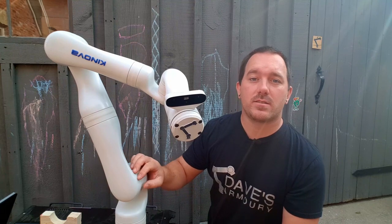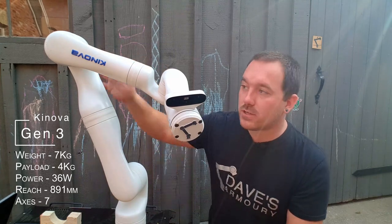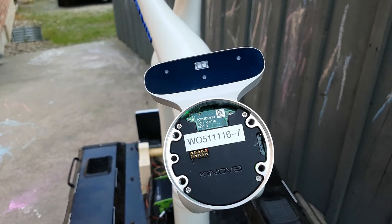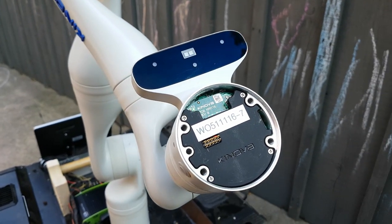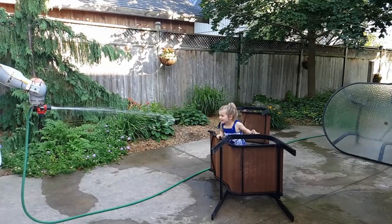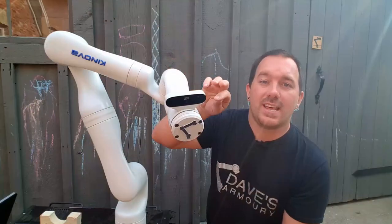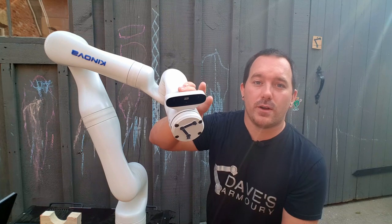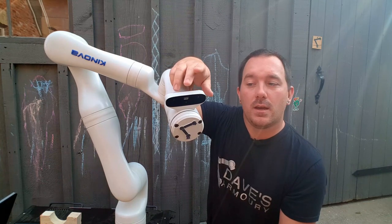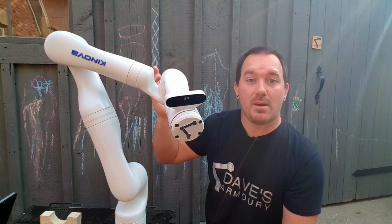For this project, we're using a seven-axis collaborative arm from Kinova — this is called their Gen 3. It has pass-throughs all the way through the arm to the end where you can use grippers or different IO. It also has a stereo camera built directly into the arm, similar to the ZED 2 we used on the shop defense — make sure you check out that video. For our project, we don't actually need the stereo portion because we're just tracking weeds, which are stationary, so we're just going to use the standard video feed. The fact that it's built into the arm and into the ROS driver already just makes our setup that much easier.